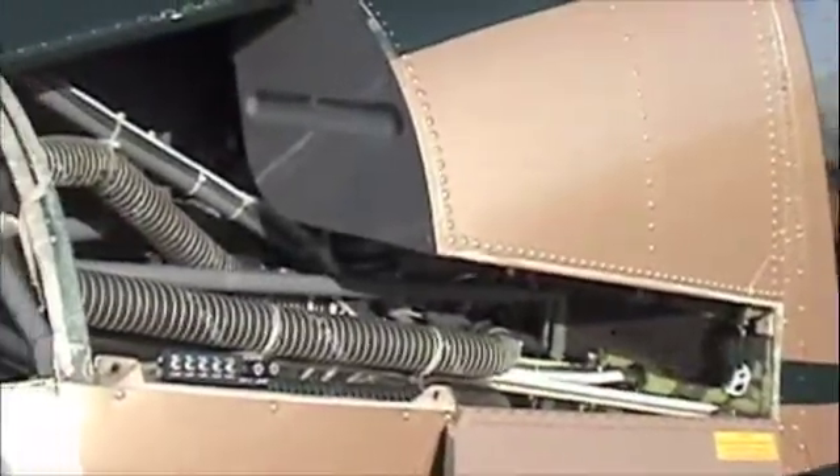We're still in the main rotor gearbox compartment, so we're going to inspect the forward yoke flange and flex coupling. The yoke flange is the gray part, and as we turn the main rotor and the tail rotor drive shaft, you're going to inspect all the way around this joint. Check for cracks, check the castle nuts to make sure they haven't moved. You're looking for any bends, cracks, corrosion — anything that may cause harm in flight. The gray part is the yoke flange and the brass-colored part is the flex coupling.